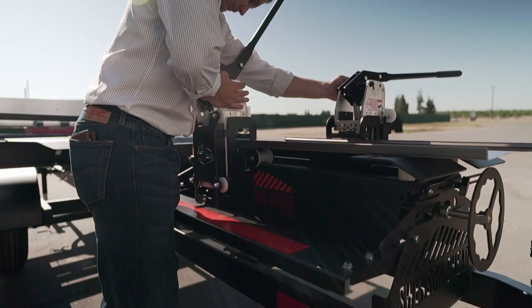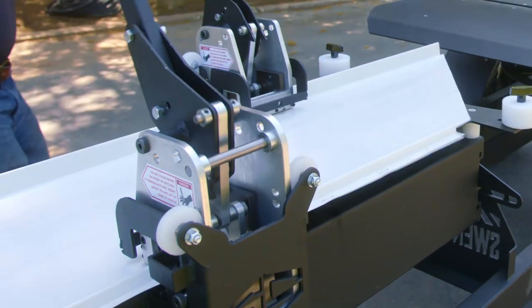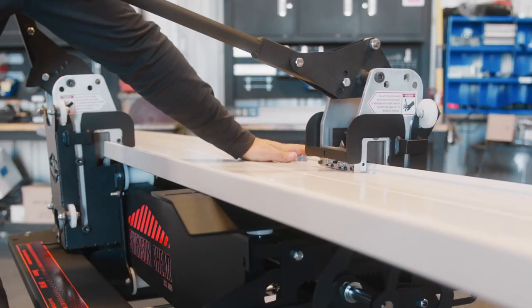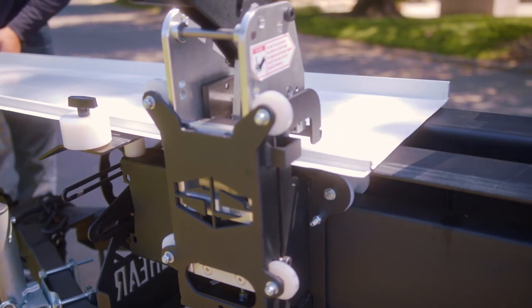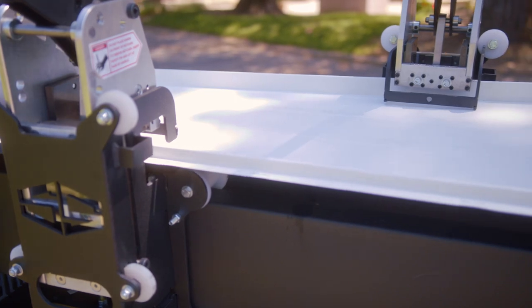To create a tab, simply offset the male notcher by half an inch, which will give you a true one-inch offset. From here, one side of your panel will be longer so you can snip the leg back and fold over with your thumb before hemming the panel.